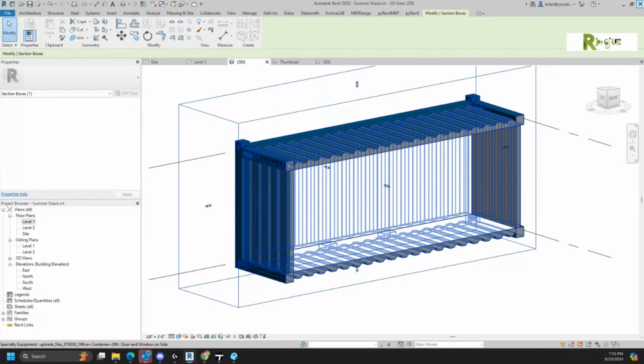If I said the term camber, do you know what camber means? Anybody? No. What is it? Camber. Yeah, well, you see these cars going down the road sometimes, and their tires are cambered. Yep. They're not with a structural member. What they'll sometimes do, and you can really tell this on a flatbed semi truck, is that when it's unloaded, it has this arc in it, right? Mhm. And then when they load it down, it flattens out. So if we put camber in a beam, we put a little bit of a curve in that beam, and then when they put the concrete floor on there and all the furniture and everything else, that weight will actually cause the floor to go down to flat.